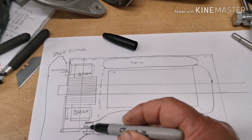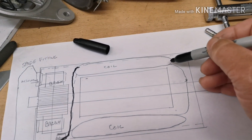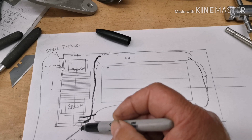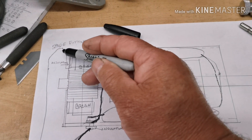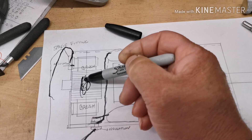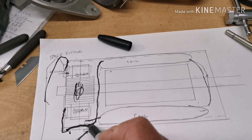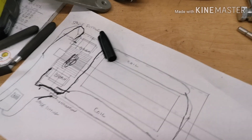You've got one wire from one coil earthed against the body of the generator. So you're going from there, up through there, around the coil - that's where the two coils join together - through this coil to that spade, going to the meter. This one going to the meter, insulated there, insulated there, is going around, spinning, and then this brush is earthed to the body going through to that wire there. That's the circuit for the whole thing.